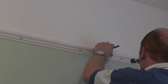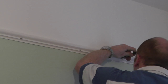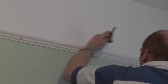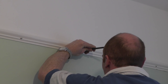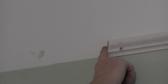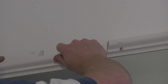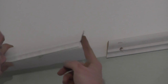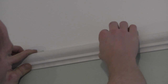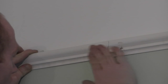Next job is to punch in these nails. Here's that mitre joint where we need to join the two lengths along one wall — that's the 45-degree cut. Our final piece goes in there and the corresponding 45 sits on there, giving a nice flush finish. Once we've fixed this and painted over, you won't see that at all.